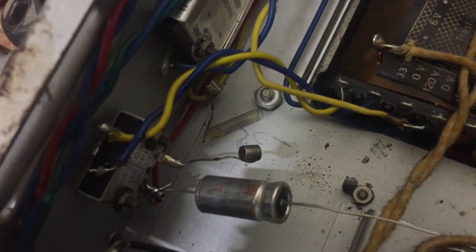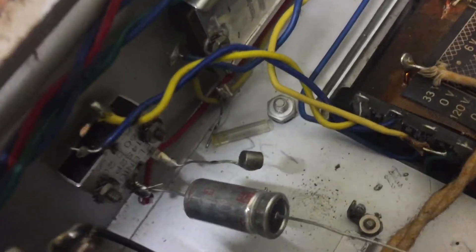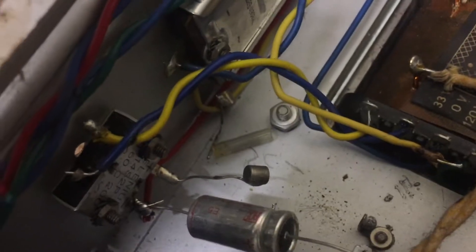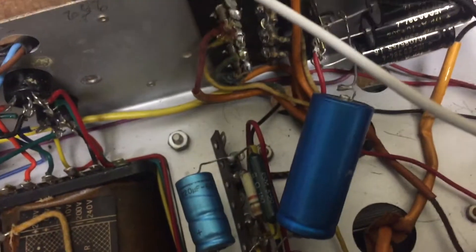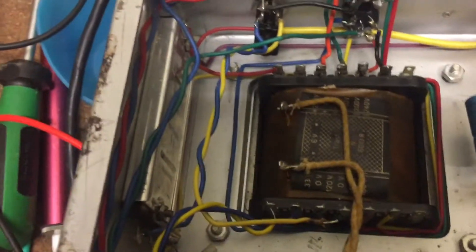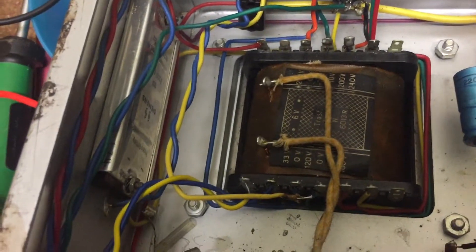In the process of soldering I wrecked this in-soldered fuse — it's completely done. But it's not on the schematic; it's maybe a modification done later. We'll leave it out for now. I will also ground this big cap somewhere else, I think with the other big capacitors. Maybe this is something to do with the noise issue — that it wasn't grounded there originally.